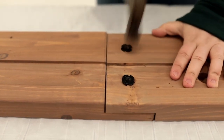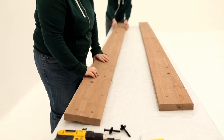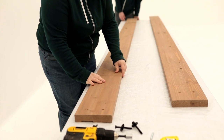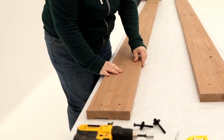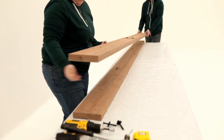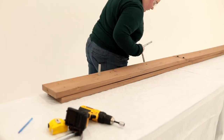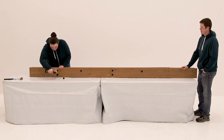Install two T-nuts into the right short beam and left short beam, then flip the assembly over so the T-nuts are facing down. The groove in the boards should be facing down and towards the top. Place the outside beam assembly A on top with the hex bolts facing out. Using three long pins, make sure the holes align and loosely attach the 2.5-inch bolts in the top holes and 2 3/4 bolts in the bottom holes.